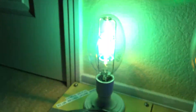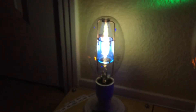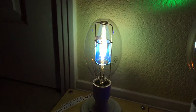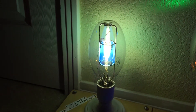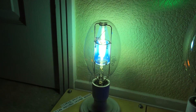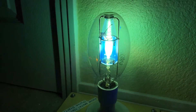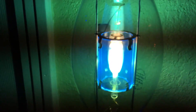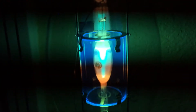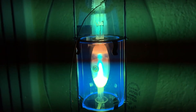Here we go. As you can see, the shield is glowing a very nice bright blue color from the arc tube. That is telling me that the shield is absorbing most of the UV radiation that is produced from the arc tube. That is the second way of how to tell if protected metal halide lamps are UV shielded. I'll give you a close-up view of the lamp turning on, because I just think that this lamp is amazing.